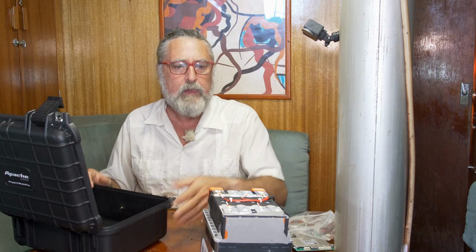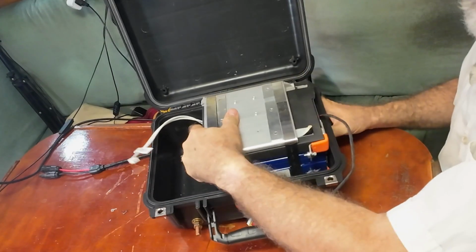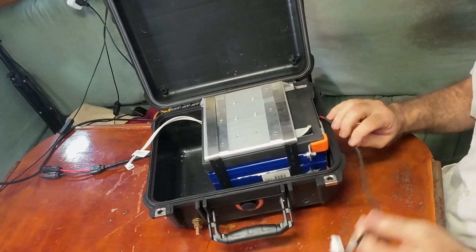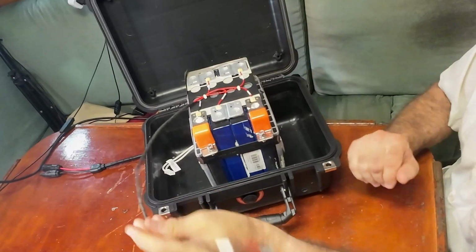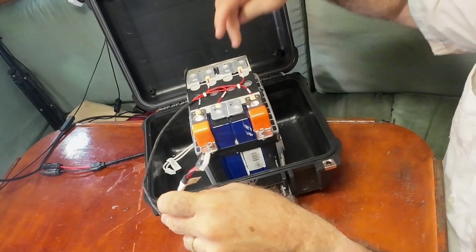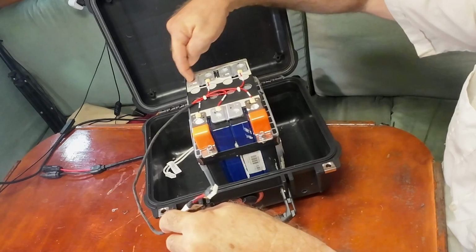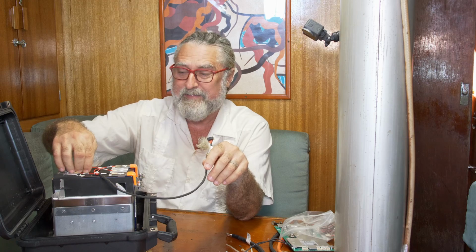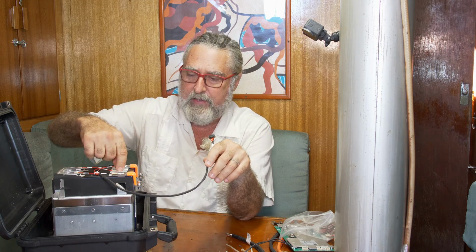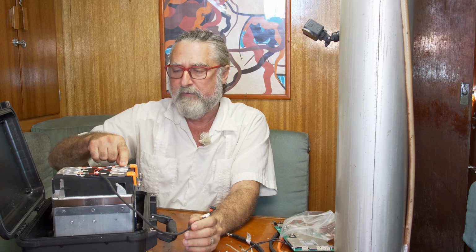All right. The battery itself in this build is going to go in this way, shoved right into the corner. The 2 wires coming out of the battery, probably should look into that here first. This wire gives me small wires going to each of the terminals. There's the most negative, and then its positive side. Of course, this is a bus bar. They're the same electrically. For the first positive, as it were, then the second one. So this is 3-ish volts. This is 6-ish volts. This is around 9 volts, and this is around 12 volts.